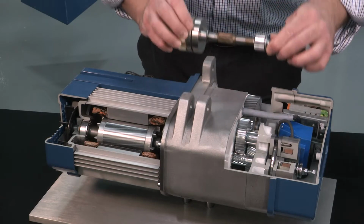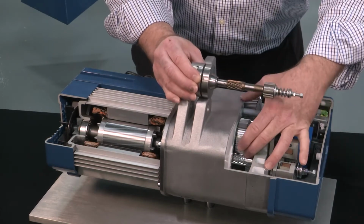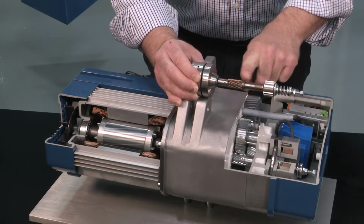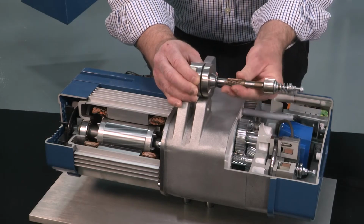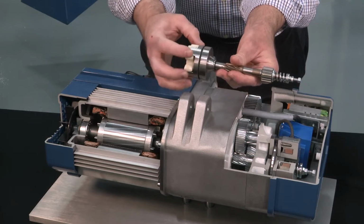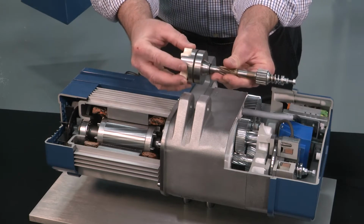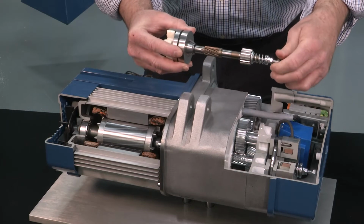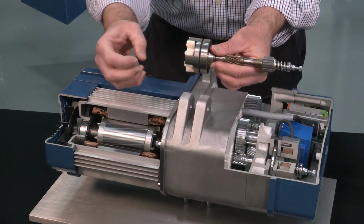So you'll notice here, inside the hoist, this clutch assembly would be just about like this. This piece right here is this section here. What you're seeing here is inside your gear train, and that would rotate, and this is your slip clutch. And then you'll notice this star washer. There's a Lovejoy type coupling that couples the motor to your shaft and your slip clutch here. And again, this is your clutch adjustment. You tighten this to make the clutch tighter or looser.